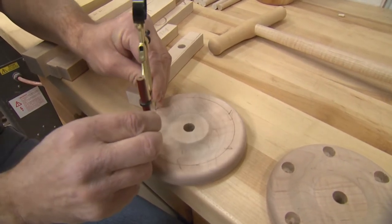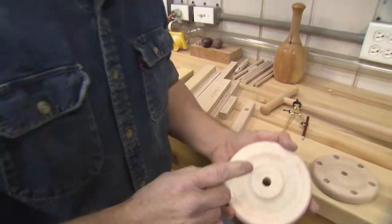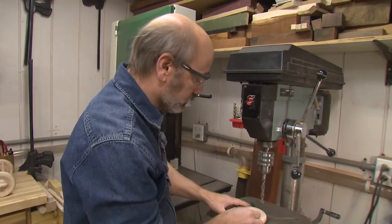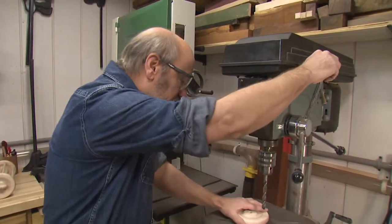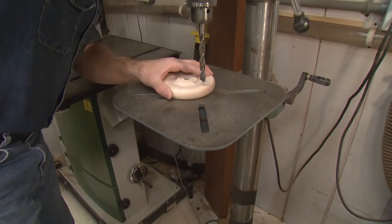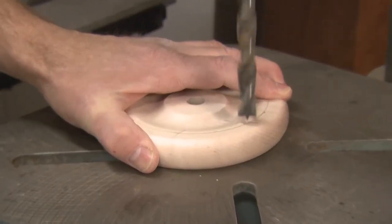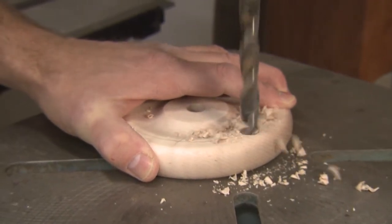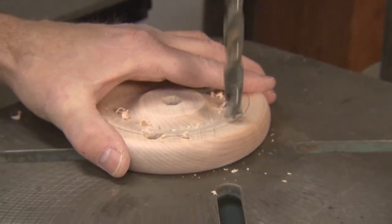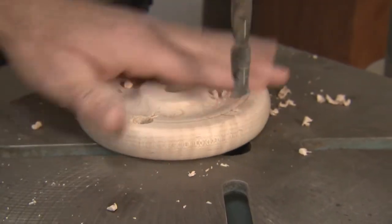Let's go to the drill press. What we want to do now is drill the holes half inch deep in here — they're half inch wide holes with a half inch drill bit. I bring the point in, and right where that cross is, I push and make a little dimple so when I start my hole it'll go nice. I've already set my drill bit to where it'll only go a half inch deep — it's got a stop on it. Move to the next one, dimple it, drill all these, and then we're back to the lathe.